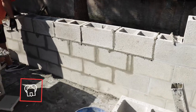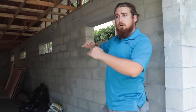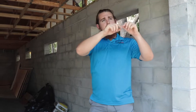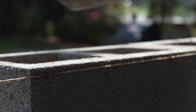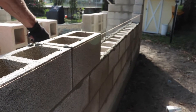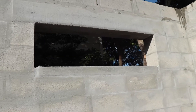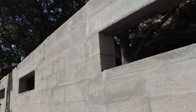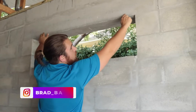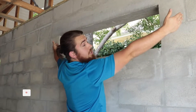He does a 50-50 offset. What our guy did in particular — he started in the back corner of the garage, built up to his height, ran a string attached to the top of the block, ran it the full length of the wall, made sure it was level, and then built his block up from there. Whenever we get to an opening, you'll see on the top from here all the way across to here, it's 8 inches over each of the adjacent blocks.